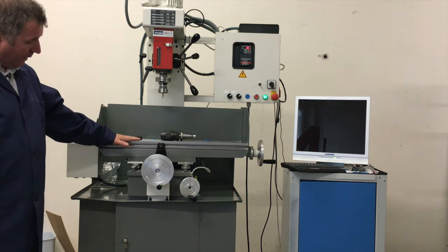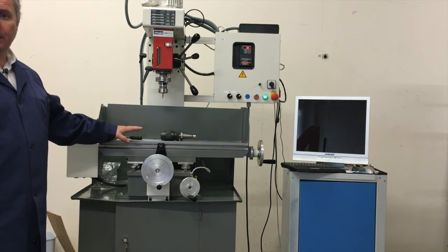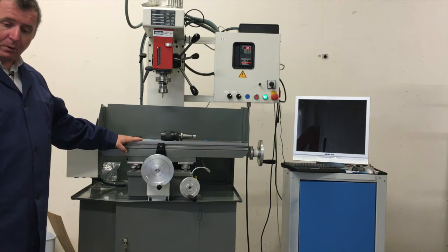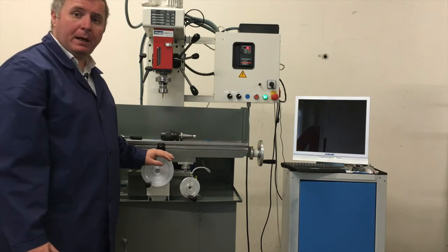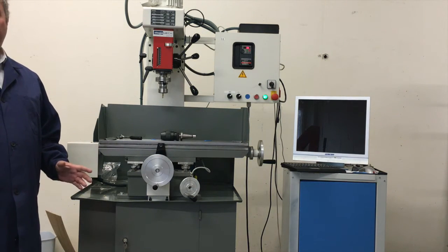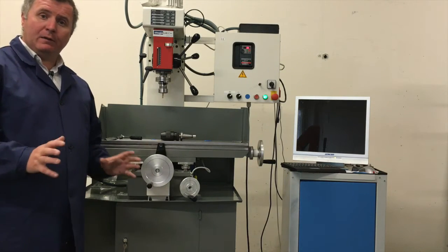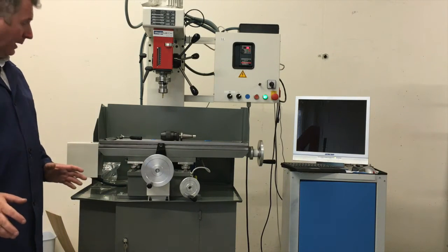The table runs on massive hardened ball rails and the spindles are driven by ball screws, so you have no backlash — nothing. This is required for the CNC. The big handwheels give you a comfortable feel so when you work manually everything is fine.